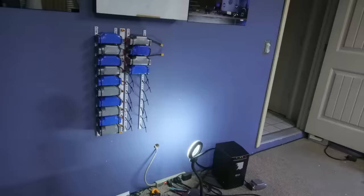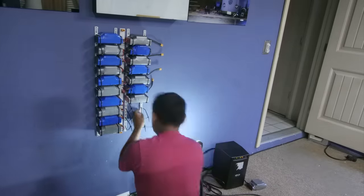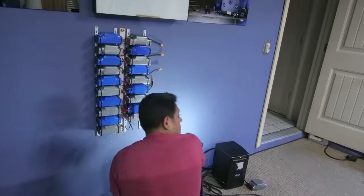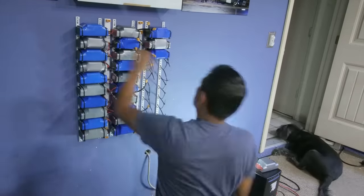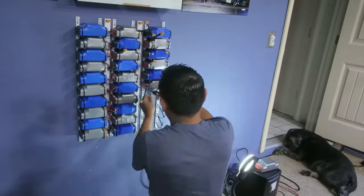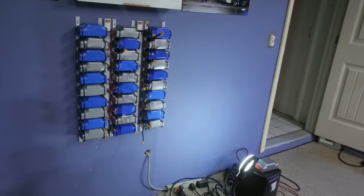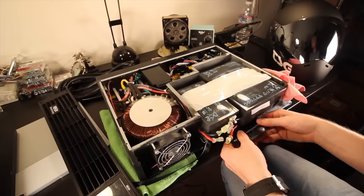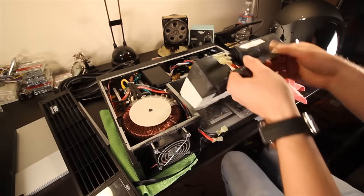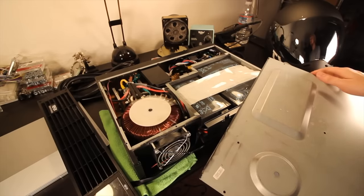Just like that I built a 30-pack power wall. Each pack is about 200Wh, times 30 — that's about 6 kilowatt hours at 36 volts. The challenge is that most equipment comes in 12, 24, or 48 volts, and there's minimal equipment available at 36 volts. I had to search until I finally found a UPS rated at about 1.5kVA — roughly 1.3 kilowatts — wired for three 12-volt batteries in series, which is 36 volts, making it compatible with our hoverboard batteries.